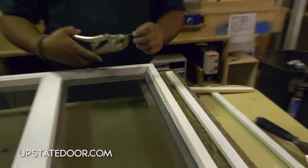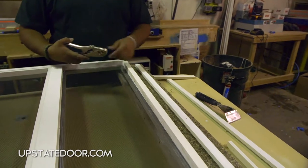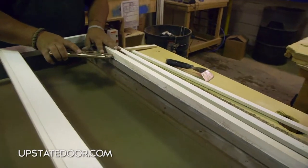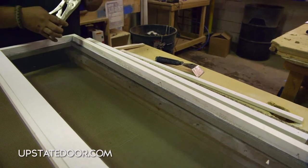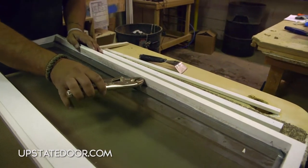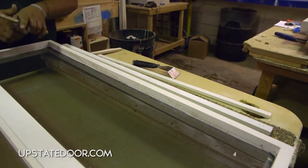The reason for that is on the outside, they will rust and corrode. Even galvanized nails with salt water will show a residue that will show up, especially with a white screen or storm door.